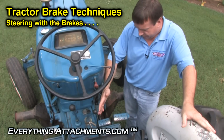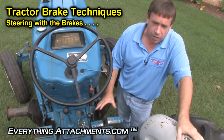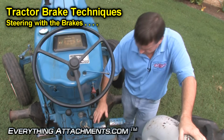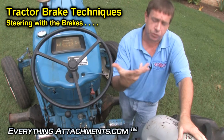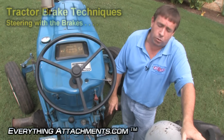Yours could be located anywhere, but if you want to try to see how to steer a tractor, if you've got a four-wheel drive compact, simply put it in two-wheel drive. There's a lot of things that you might find it convenient to lock down one brake or the other to spin the tractor around in a really short distance, much shorter than you can turn a four-wheel drive tractor around in.